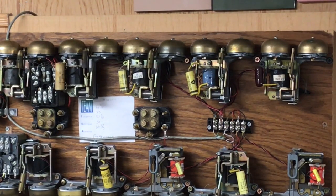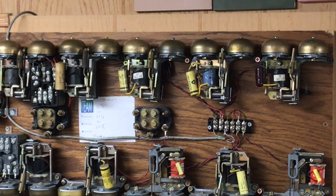The ringers on the top of the brown backboard represent a five-party telephone line that has five frequency-selective ringers. Starting at the left side is a 20-cycle ringer, all the way up to a 60-cycle ringer on the right-hand side of the board. This is connected to a North Electric switching system that has the ability to send different frequencies down the line depending on the telephone number dialed.